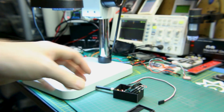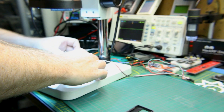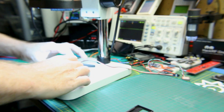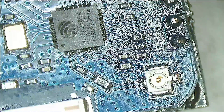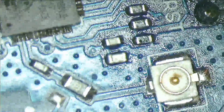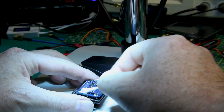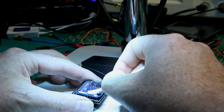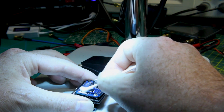On this particular build we have to move a resistor that acts as a shunt to access a connection on the board, from one contact to another, to enable the external antenna and disable the internal one. I did this under the microscope — I failed miserably to get it on camera, but I did a whole video on this and it's in the RESCU unit playlist.